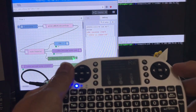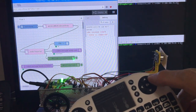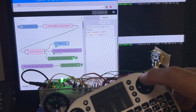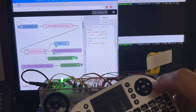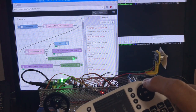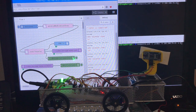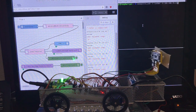I am now going to use the up, down, left, and right arrows and the OK button on the mini keyboard to generate F, B, L, R, and S MQTT messages to tell the prototype to move forward, backwards, left, right, and stop. These messages are received by the prototype and the second Node-RED flow, which are shown in the debug display. We will see these messages being displayed in the serial display on the iMac later.